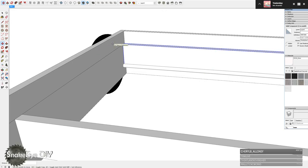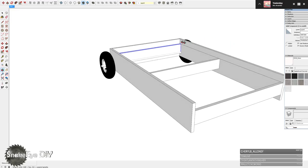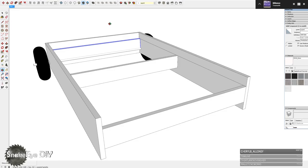The design for this is to reduce weight. If you have any sort of rigidity issues, we could always add like a 2x6 or 2x4 somewhere along in the process. But I think 1x wood is going to be fairly sturdy, especially if it's glued.